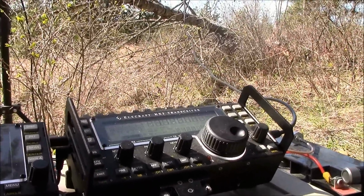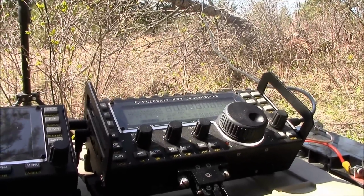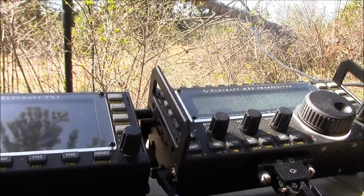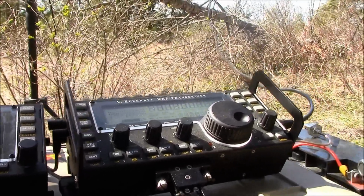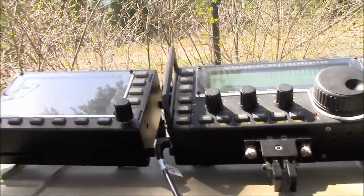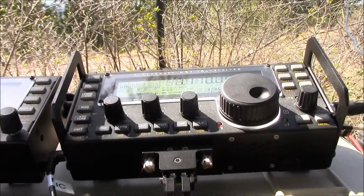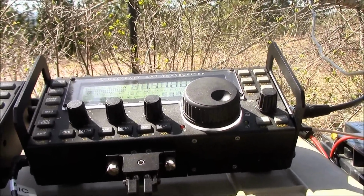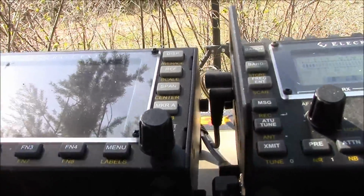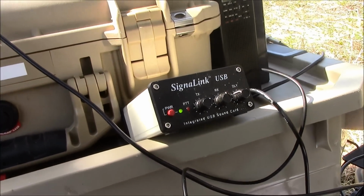I'm getting him, but he's not getting me, and we're using NVIS, which right now he checked, and we should be about 5 megahertz. And of course we're up in the 7 megahertz, so it's not going to work on 40 meters for us right now. Probably later in the day. It could change in an hour, but that's what we got so far. But I am able to copy him and receive him right now, and easily able to hit that repeater over there on 2 meters. And he did see my signal. He was able to have a partial copy on me, but not a full 100% copy. So a lot of that could just come down to a matter of the time of day for us. Cool. A good field training exercise.